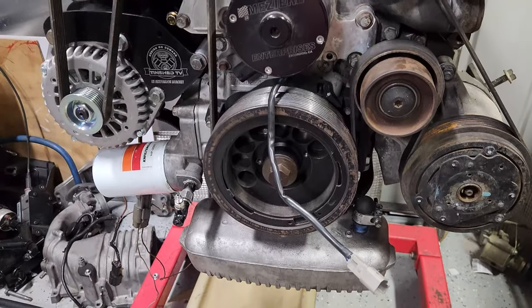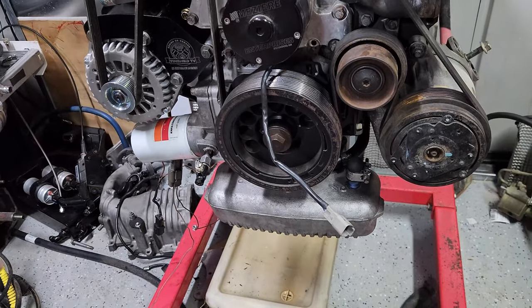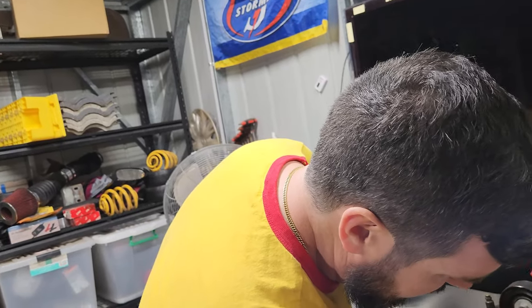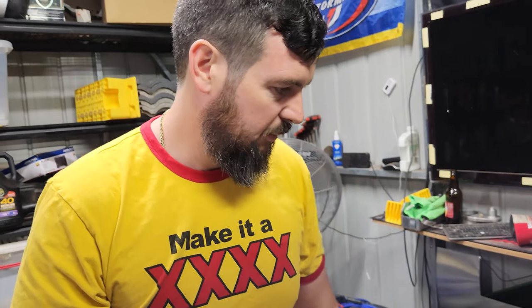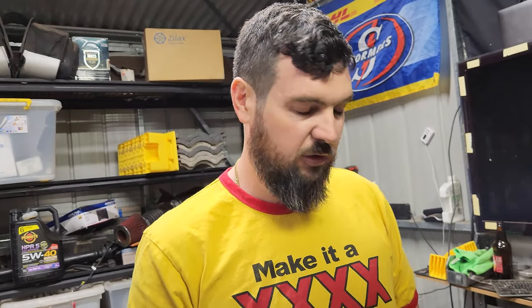On the back of that overdrive balancer you do have markings, but the Haltech is only going to be using the times eighteen marker. So we basically need to mark some stuff on the front of it — put a little piece of metal there — so when Barry shoots the car and we put a timing light on it, we'll fire in true top dead center.